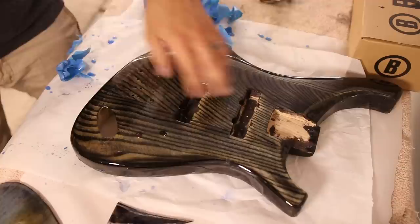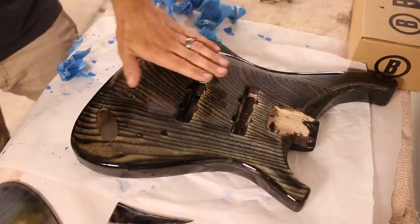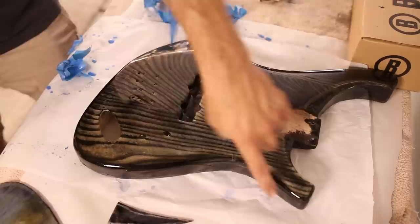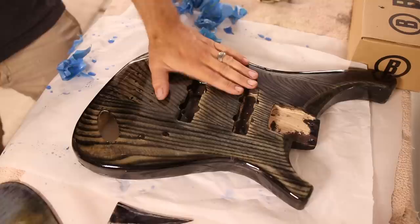Fails are not fails if you learn a lesson from it. I tried something new and failed, and I think you're allowed to fail doing the right thing like trying something new. I learned a lot of lessons: I put the epoxy on way too thick — I just poured it on and smeared it with a spoon. I need to add more color to the resin and put a thinner layer so there are fewer opportunities for drips, runs, and sags. And I need to focus a lot more on my masking, making sure I mask off really well even for the first coat. Lessons learned — but I also need to learn how to fix this should it ever happen again.